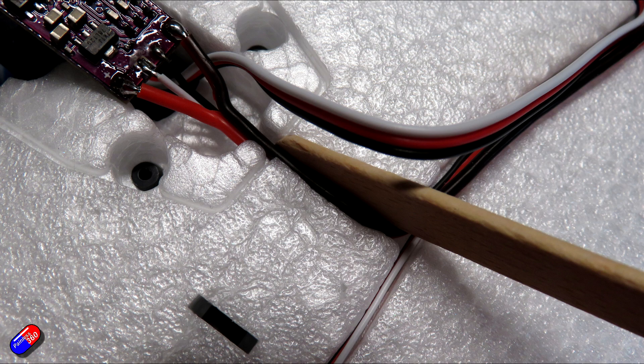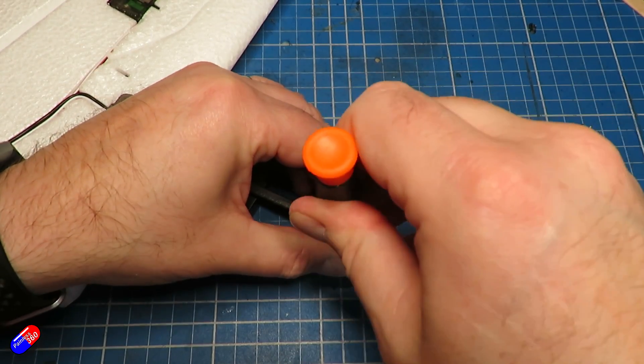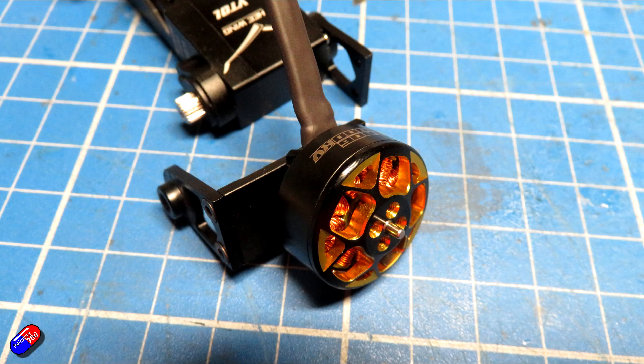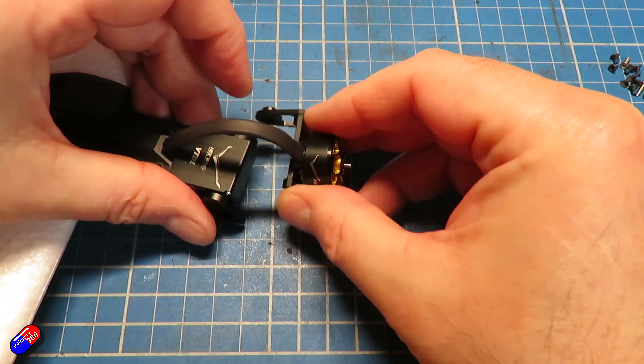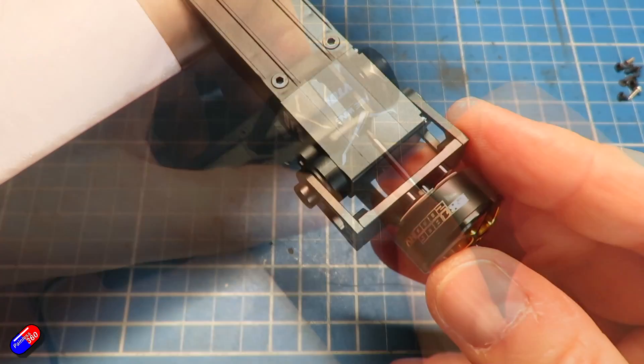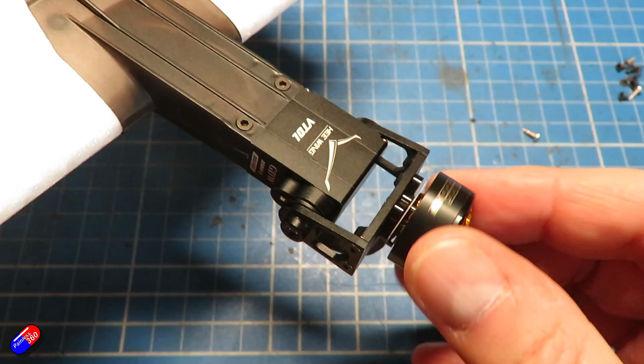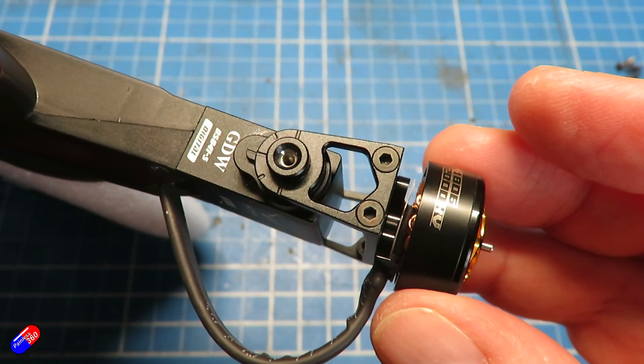Next, finish making the cage for the motor. Put everything out on the table and test fit so it's obvious how it goes together. Screw the plate into the back of the motor, and also screw the end piece on for the servo. Then push that over the output shaft of the servo and use two of those small black screws to lock it in place — a very precise tilting mechanism directly connected to the servo.